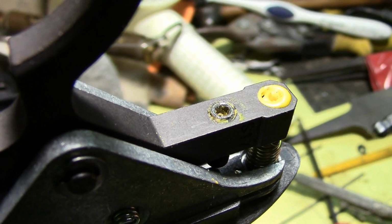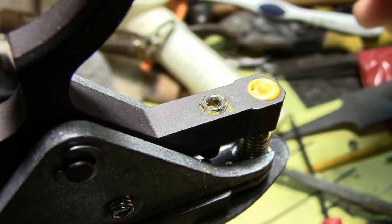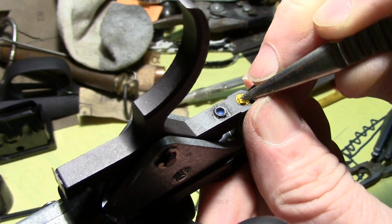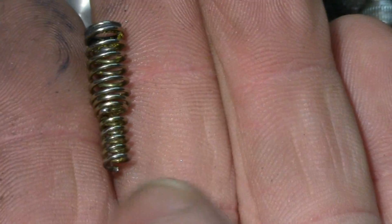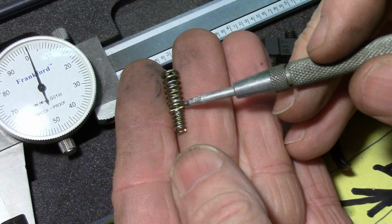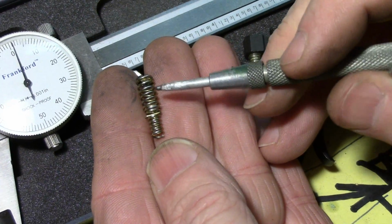The Axis trigger has a hole drilled at the rear to accommodate the trigger return spring. Let's remove that spring. First, chip away the adhesive they use to lock the spring in place. The hole in the trigger is tapped, so you will need to unscrew the spring to remove it. The fact that this hole is tapped is a major boon for us. This is how we will install an overtravel screw.